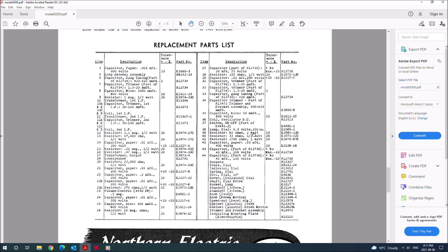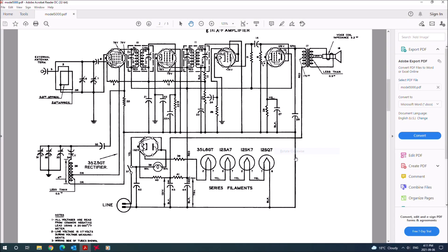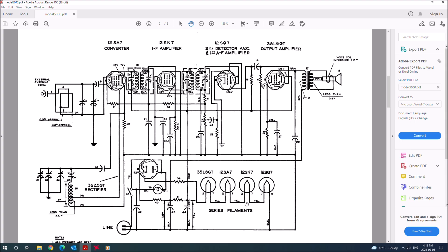From this parts list, the power supply filter cap includes a 20-microfarad capacitor at 25 volts and two 40-microfarad capacitors rated at 150 volts. We also see that the 2-watt resistor that blew out its guts is 82 ohms. Back to the schematic — this is your standard five-tube radio, commonly known as the All-American 5, even though this is all Canadian. There's no power transformer and the filaments of the tubes are in series: a 35-volt rectifier, a 35-volt power tube, and three 12-volt tubes — the mixer, IF amp, and detector/AF amp — for a total of 106 volts, approximating the wall voltage. Another common configuration uses a 50-volt power tube for a total of 121 volts. In this case, that 82-ohm resistor is also in series with the filaments, contributing to the total load.